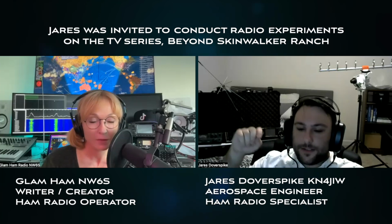Yeah. So unfortunately, I never worked our satellite due to a couple of technical problems, but I have worked different satellites. One of the really cool things you can do with your RTL-SDR, as well as any other SDR type radio, and even non-SDR types, is look at the NOAA weather satellites. You can actually get the imagery off of that and reconstruct the images that are being sent back to NASA. And on a dongle? Yes, on a dongle. Good God. And so you can look up the NOAA weather satellites.